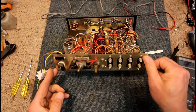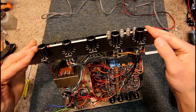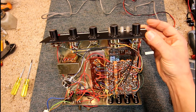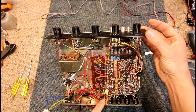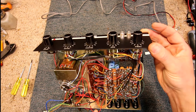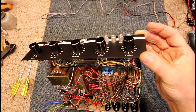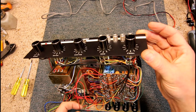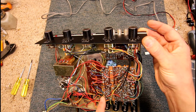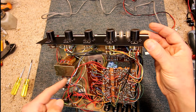I've got to work out what's even the speaker connections. There are left and right there, but whether that's for speakers — there are 10 ohm 10 watt resistors there, like they're trying to drop the level down. This is going to be hard to work out what the actual output is. I've got two connections here — one goes via a pot, the other goes via another pot. I have no idea what someone's done to this thing. But there are our output transformers and output transistors, so it's got to be some of these connections.